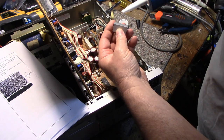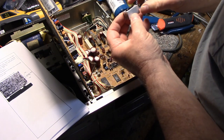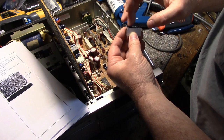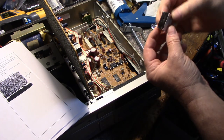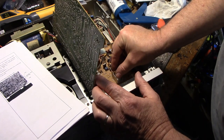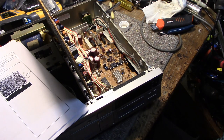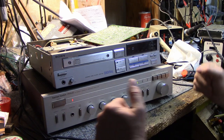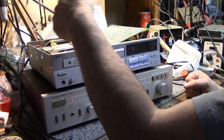I'm going to coat the heat sink with a very thin line of silicone thermal compound and mount it on like that. I'll let it set up — I won't touch it for a few hours, maybe overnight. I believe I've got this sorted as best I can. The re-lubrication of the CD chassis, all the different gears and levers — it was all just gunked-up grease. I took it apart, cleaned it, and now it seems to be working great.